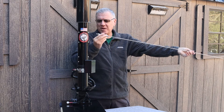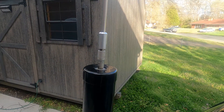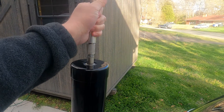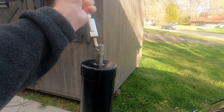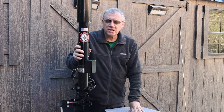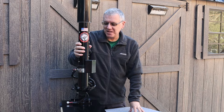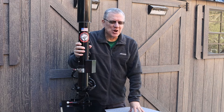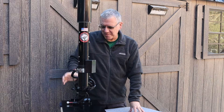It comes standard with a 66-inch whip. I have a quick release tab on mine, and this allows the full use of the entire bandwidth of the antenna. This antenna will accept full legal power, so I can use a 1500-watt amplifier with it — that would be insane in a car, so of course I don't do that, but it will take full legal power.